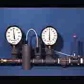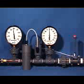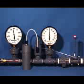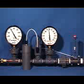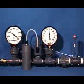Now for the ultimate in performance, we will demonstrate the PRA and PRS Stabilizer. This combination uses compressed air instead of a spring. Using the same parameters, at a no flow condition the PRA and PRS is set at 30 PSI. As we simulate system demand for flow by opening a manual ball valve, we naturally expect the downstream pressure to drop. As we approach 3 GPM the pressure has only dropped 1 PSI. As we continue to open the manual ball valve, the flow increases to 6 GPM with a pressure loss of only 2 PSI. As velocity increases, the PRA-PRS combo will accurately maintain downstream pressure with virtually no droop or change in flow characteristics.